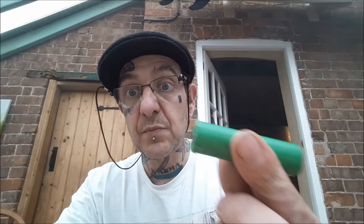One of the things that concerned me — because obviously these boxes are made out of aluminium or alloy — is that if your insulation on your batteries isn't tip-top, you're in with a good chance of shorting it out. I've got one of my old soldiers here and look at the state of it — you can see where it's caught on battery terminals and been used and abused. I've probably had it a year, it still takes a good charge, still delivers the goods — the old Sony VTC4. However, with the insulation in that state, it's not really safe to use, certainly not in a tube mod. This mech mod is just made of copper with a brass switch, there's no safety features whatsoever.